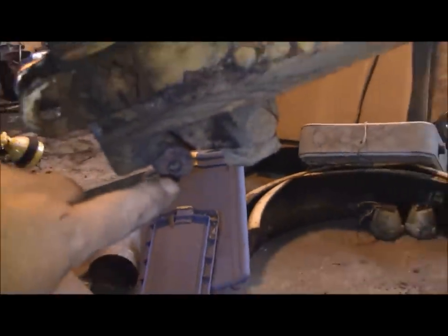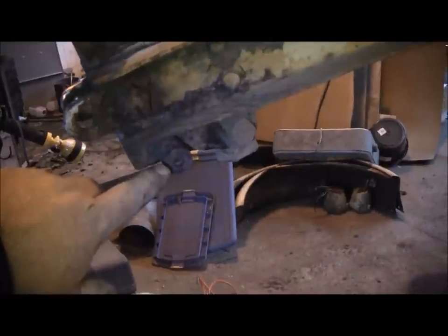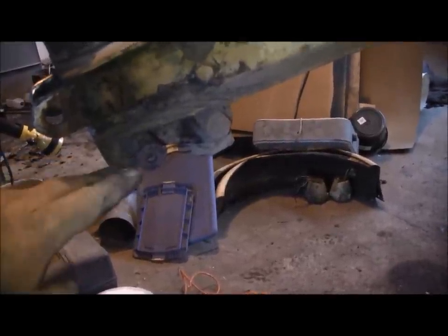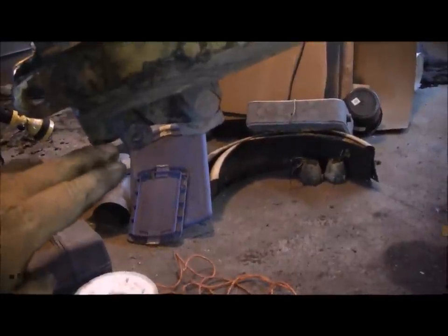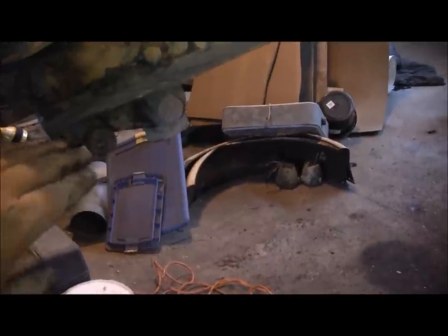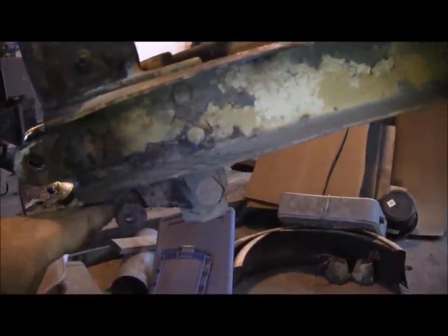The next problem is going to be the leg. The leg pin was in the center of this area here, and the leg pin has a handle on it — it should come out and have a handle on it. In behind here should be a spring, which is probably rusted and collapsed by now. This is broken off and I've ground it flush. I've heated it once and tried to drive it out with no luck so far, so I'm going to have to continue heating the casting and trying to drive this out.